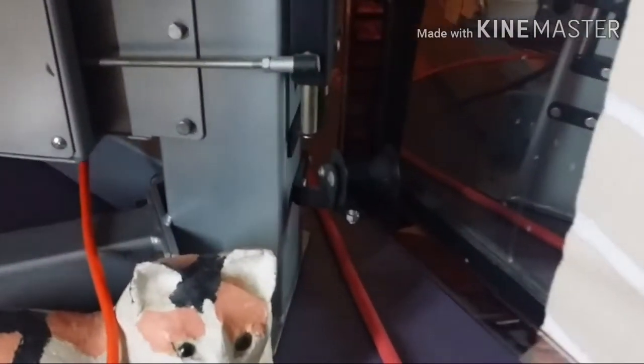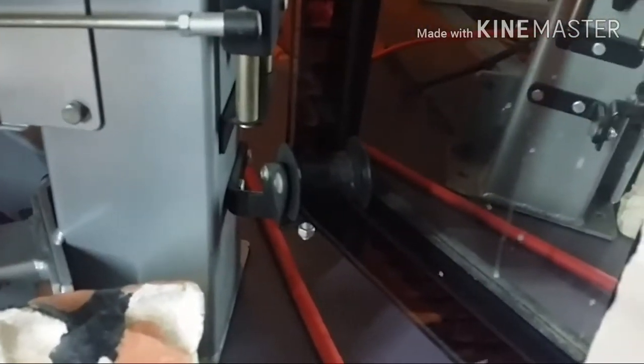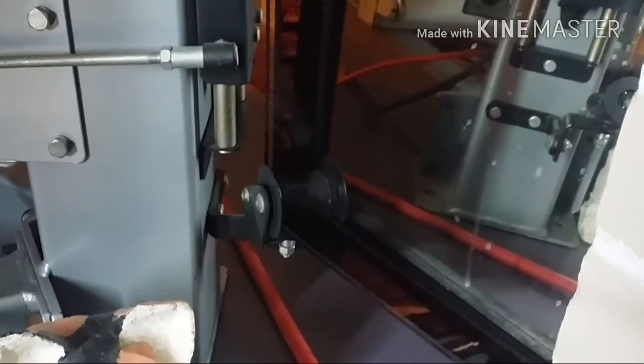So, once the film leaves the projector, we will go down to an outfeed guide roller and then go along underneath the projector to another guide roller, which just bends the film to a 90 degree turn so that we can go back over to the platter tower. This is the infeed guide roller for the take-up side of the tower. Barely see it. I need to get a better light on this. You arrive back at the tower, at the base of the tower, to the infeed guide roller side of the take-up.